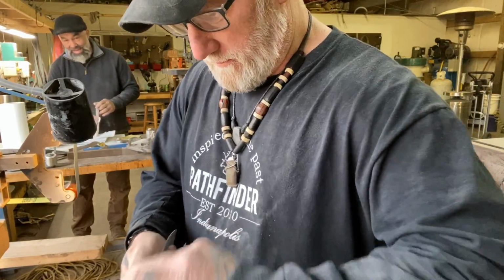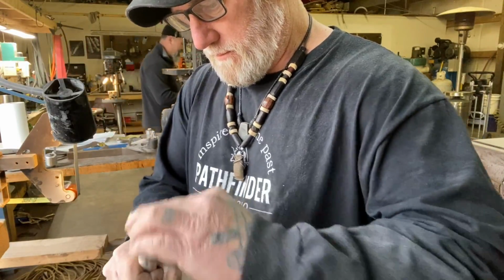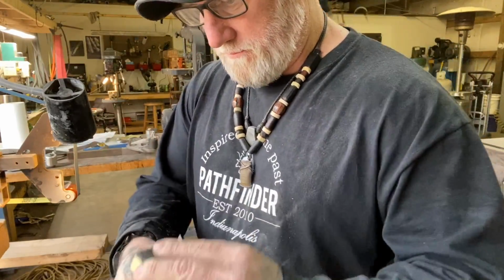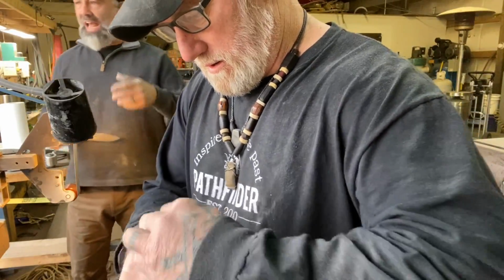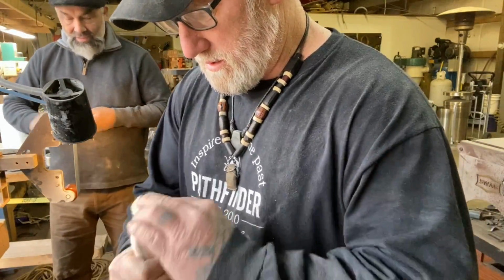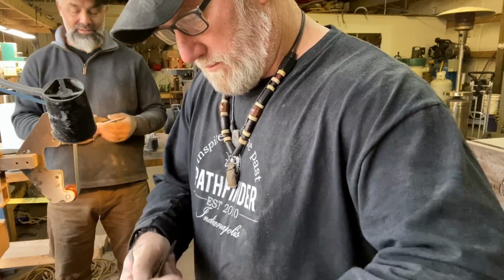He made a lot of knives, and he would rough grind all the knives to like 40 grit or 50 grit. He'd do 60 of them hollow ground, and then he'd send them up and have them heat treated. Then when he got them back, he put the handles on, and I mean he did stag and wood, all kinds of stuff. They were perfect knives. They were beautiful knives, and once the handles were all done and buffed, then he'd go back and finish grinding the blades and buff the blades and then sharpen the blades.